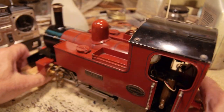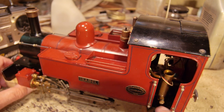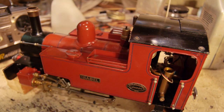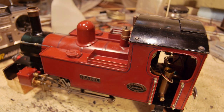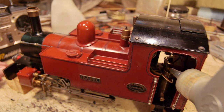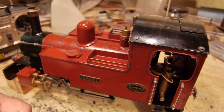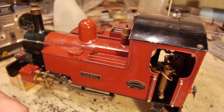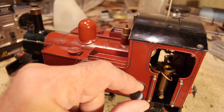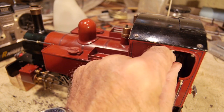Now I'm going to fill up the cylinder lubricator. I take the top off — I've previously drained it through the drain plug because the oil is hot and flows out quickly at the end of a run. I add a little bit of oil and let it settle; you can see the bubbles coming up. Fill it to just above the pipe that cuts across the top of the lubricator.